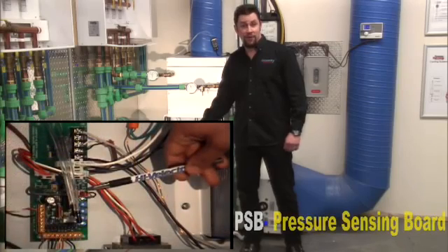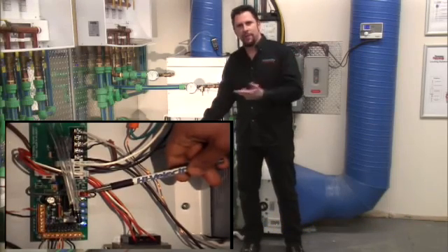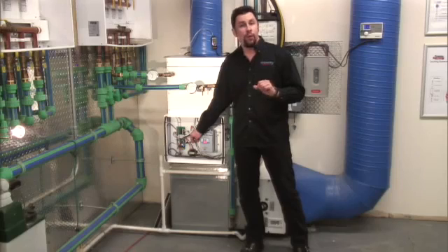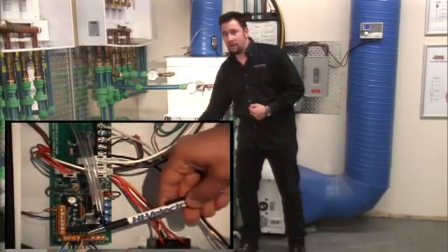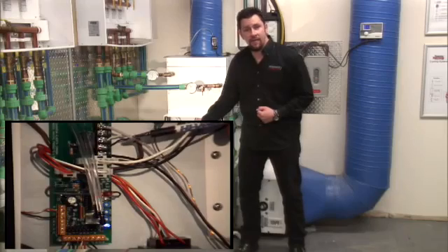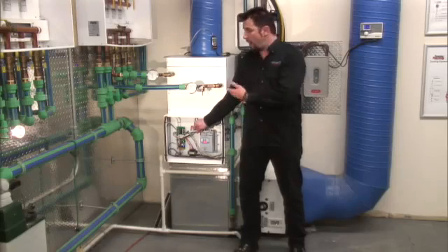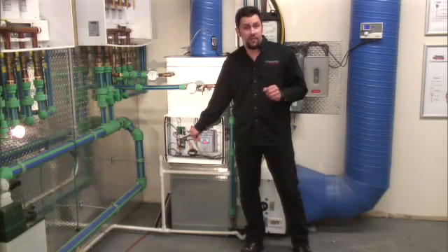The new PSB, our pressure sensing board, has the ability to adjust three speeds independently: your heating, cooling, and constant fan speeds with the potentiometers that are built into the board. By turning a potentiometer counter clockwise you will be decreasing the airspeed; turning it clockwise will increase the airspeed. The PSB board is going to feature our 24 volt input section, our 24 volt output section, as well as our auxiliary heating relays which you can hook a pump directly up to and power a pump that is circulating the hot water through the fan coil.